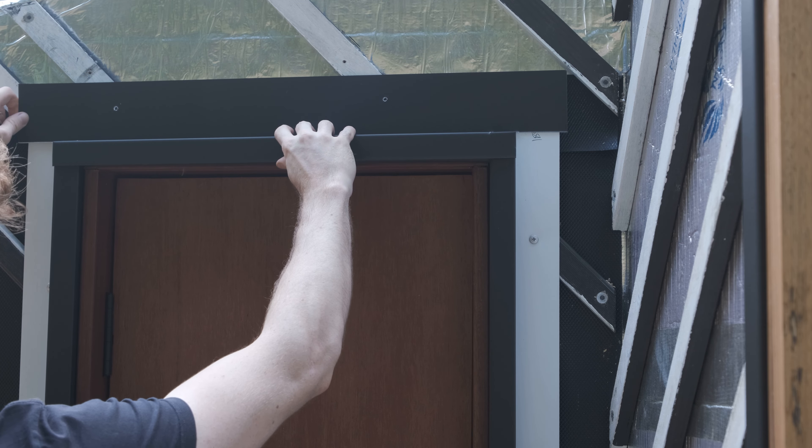With the scribed line I add some extra space before the cut so that there is material to fold over into the flashings on the top of the box, which will hold the panels to the roof in addition to the clips. I'm using a jig I made to help cut these panels down — with it I can use my track saw to get very accurate cuts, which works because I have a metal cutting blade in at the moment. For the angled cuts at the sides of the roof I use the track saw normally, but I'm careful not to cut all the way through the panel as the saw could drop and cause an accident. Instead I'll use snips to finish off the cut.